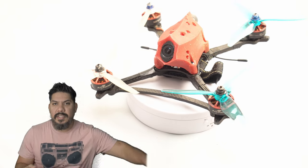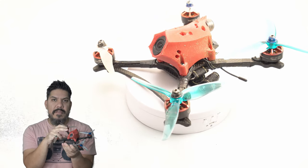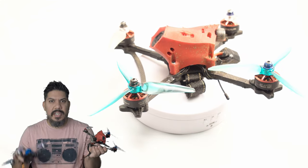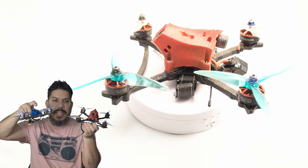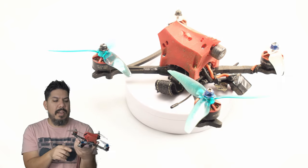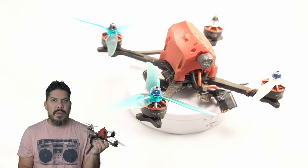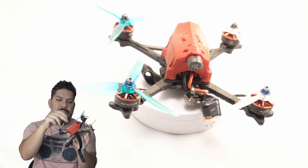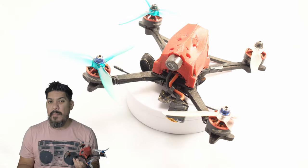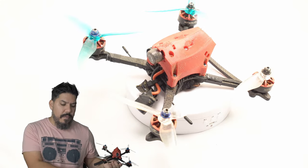This is the new DJI racing unit I built this year. It also has the Mamba Race stack — the 75-amp version — and Xnova 2207 motors, which are essentially an older precursor to the Heads Up motor. The flight feel across all three quads will be very similar. It's a slightly lower KV but a great motor, and I have consistency across all of them. The frames are essentially the same — arms, braces, and even motors are almost hot-swappable.